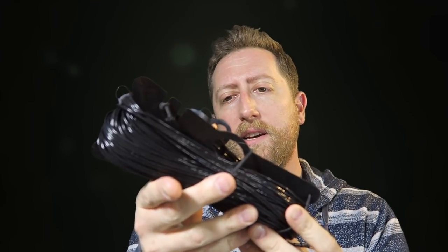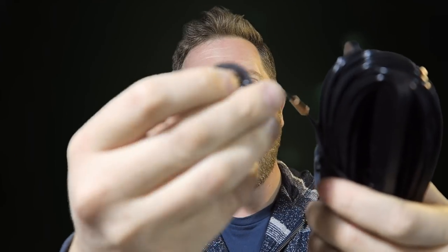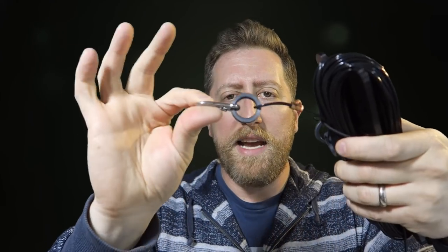One of the cool things about this antenna is that it can take a pretty decent amount of power: 500 watts on CW or 250 watts on single sideband, which is pretty good, and I would assume 100 watts or less for digital, particularly FT8 if that's the mode you're using. Aside from the matching box, the kit comes with a wire winder and 110 feet of what they call copper-clad Kevlar line. What makes it pretty cool is they've added little insulator rings with a little carabiner on all the cable joints or connections so you can have a nice insulated connection to whatever metal mast you're using.